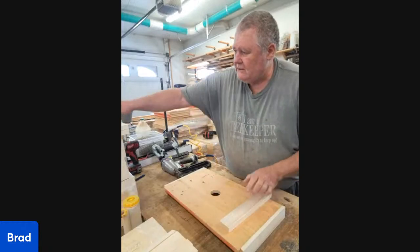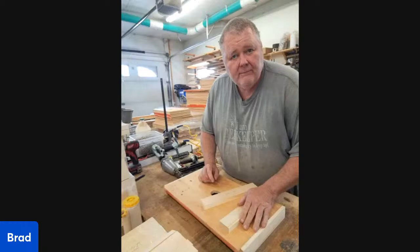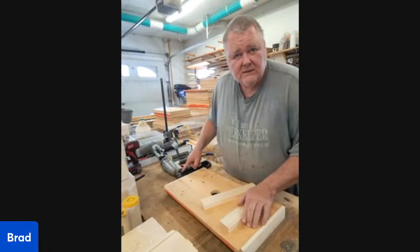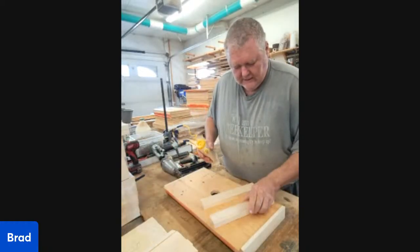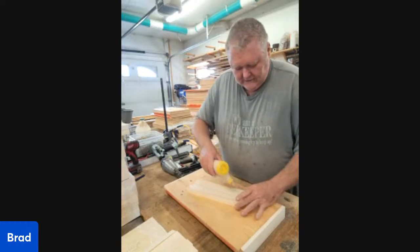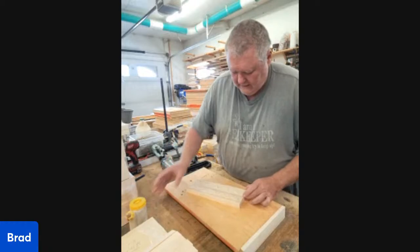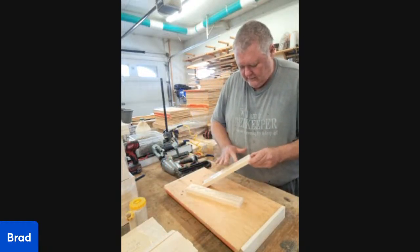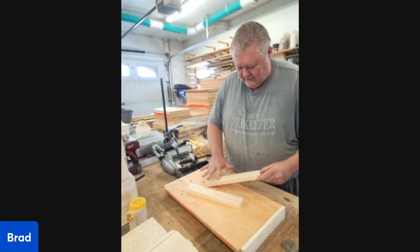Now the top cleats go on. Did you mention what size nails your Brad nailer takes? Yeah, it's a 16-gauge 2-inch nail. Okay. So top cleat, again, I'll choose whatever's the nicest side, and I'll start on the bottom, put some glue here. I should have my brush, but I just have my finger right now. That's a sticky situation. I'm giving it the finger.